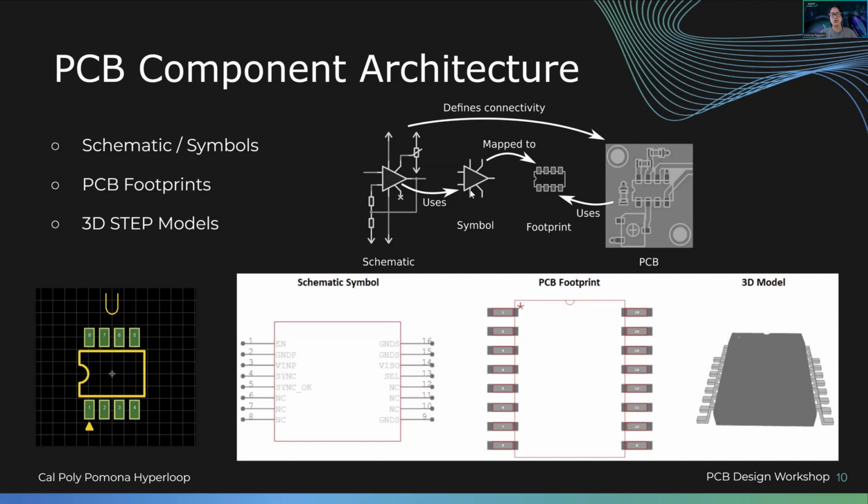And then we have to convert, what does that symbol look like in physical format, something that we can actually see and touch? I'm sure you went through the workshops, now we have a footprint. Or what you see on your breadboards, right? So that little chip, this is the 2D version of it. In order to create that board or that PCB, you'll need a footprint, and this is where the PCB librarians come in. Their job is essentially to help manage the databases that hold these footprints, and they manage the footprint to data sheet compatibility.